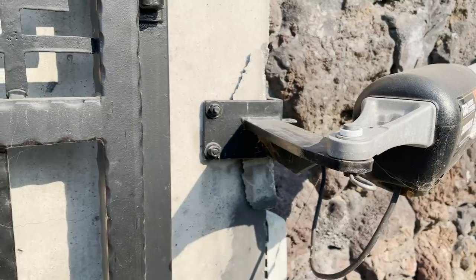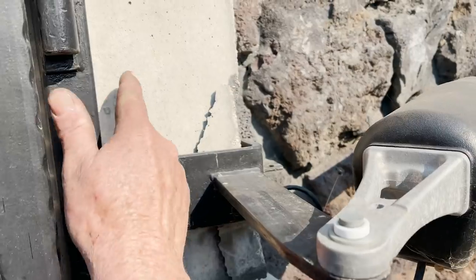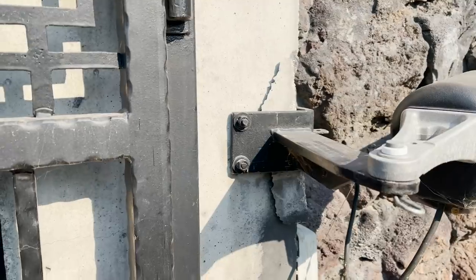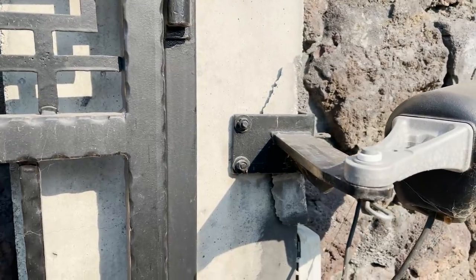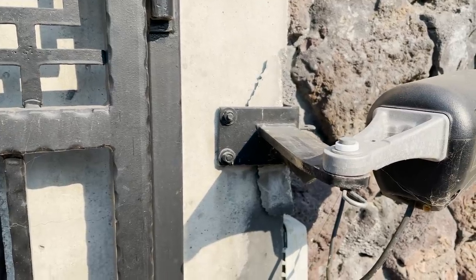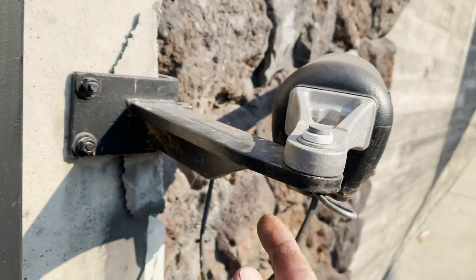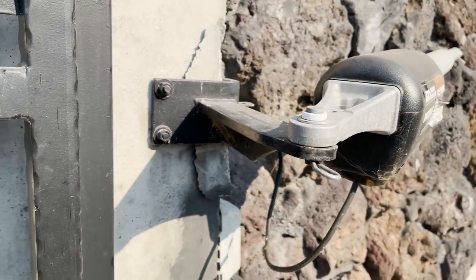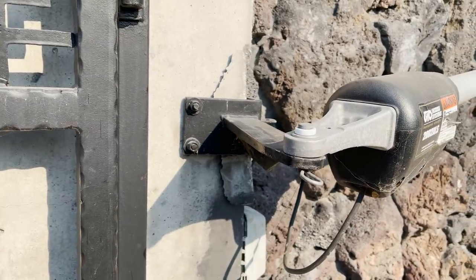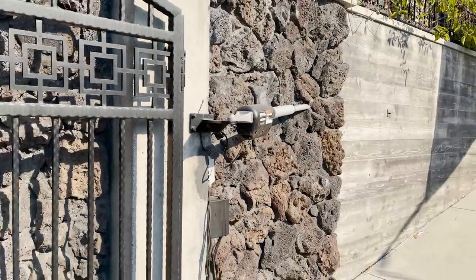I think the goal is to make a bigger bracket. I'm going to get a big piece of angle iron, probably about a foot long, maybe some 5 or 6-inch angle. Wrap the corner, put about 8 bolts in there, and hopefully that will solve the problem. I'll go ahead and fabricate a bracket very similar to what's right here. So let me get some measurements, figure out the material, and let's get back to the shop and start today's video.